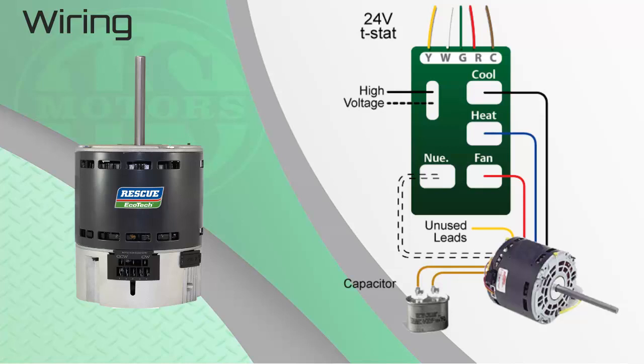The wiring of the motor is pretty simple. High speed connected to the cool tap, medium speed to heat, and red or fan speed connected to the fan pin. And of course the 2 capacitor leads to the cap.